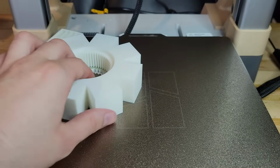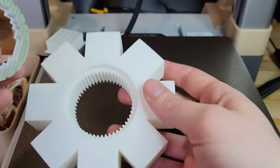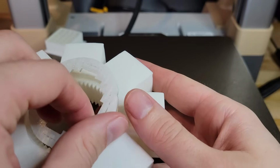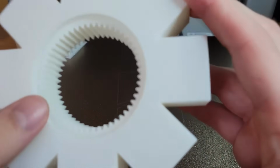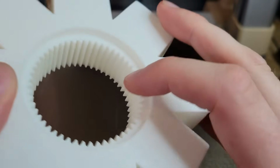My main material I used was PLA because it's available in a ton of different colors. But I could use PETG as a support layer in between the support that holds up the parts and the actual parts themselves. So that way, when I actually went to remove them, the supports just fell right off. I didn't have to spend any time cleaning up these parts afterwards.